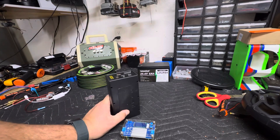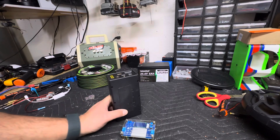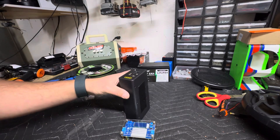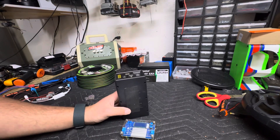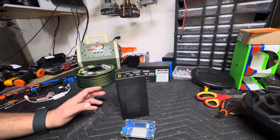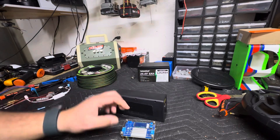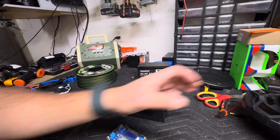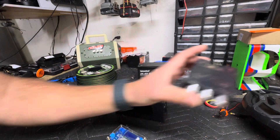You have B1, B2, and A1. On the bigger ones, which are B1 and B2, you use it because the battery will overcharge to 29 volts at full charge. So you use this to limit the output voltage to 24, not causing issues with the ZK-1002T amplifier.